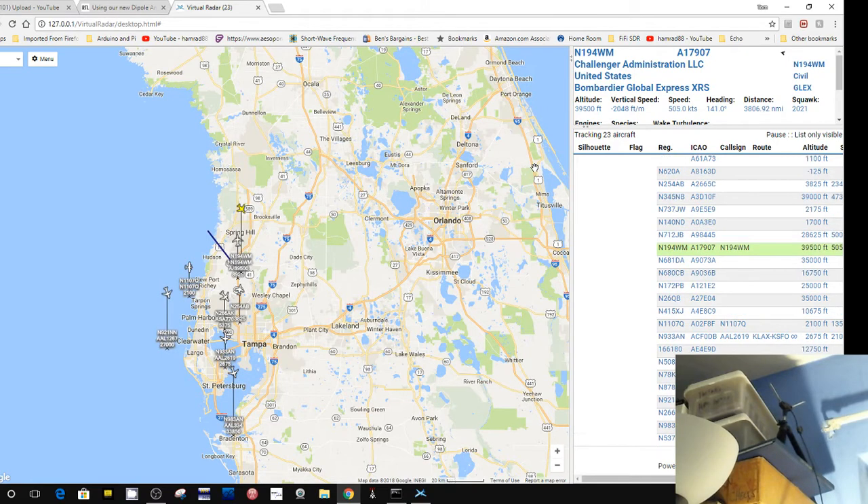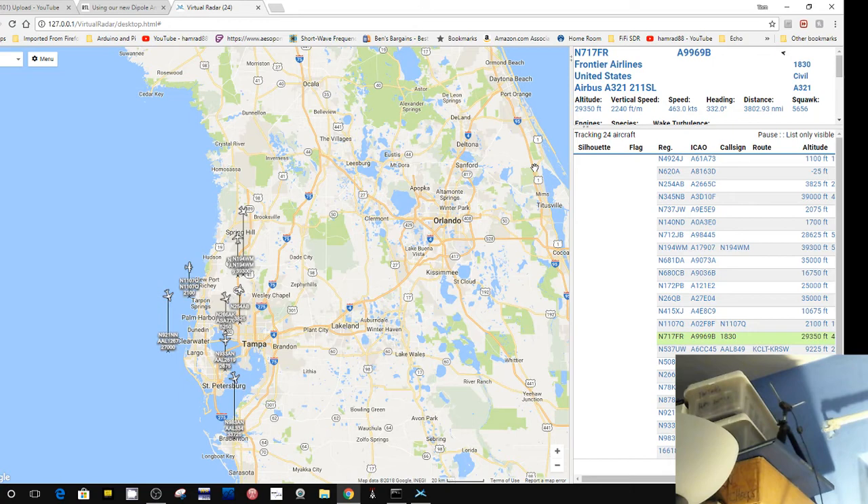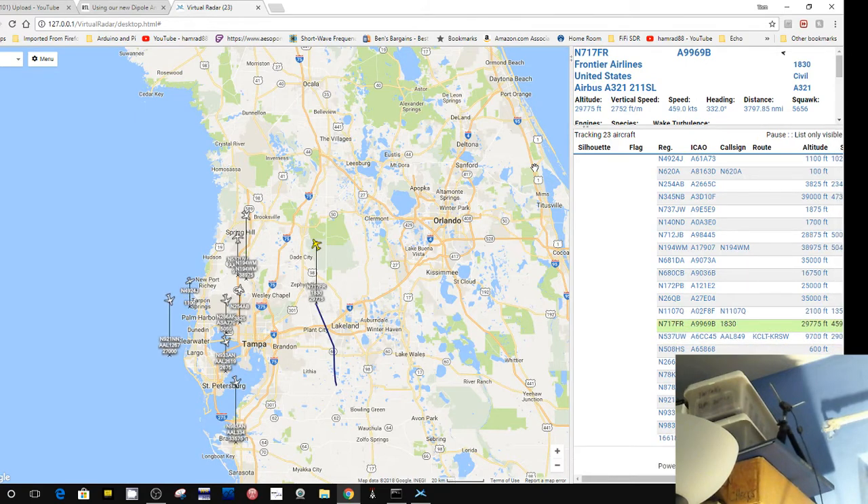I would think the orientation I should have — but let's go back to the orientation I have. I have the antenna with the two parts of the dipole pointing kind of at 45 degrees to the sky. The better configuration is probably to have it vertical. So I'm going to move the antenna around and see if I can detect any improvement in reception.